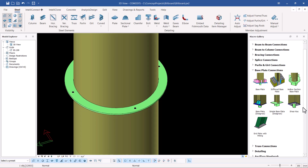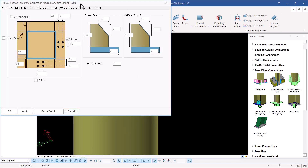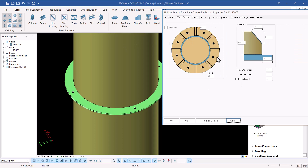We are going to modify this to create our flange connection between the bottom column and the top column. We have two scenarios — box section and tube section. This is a hollow section or tube section. Under tube section: from the edge of our pipe I'll give it approximately 100; from the edge of the pipe to the center of the bolts, 50; the height of our stiffeners, 150; and the flange dimensions, 80.